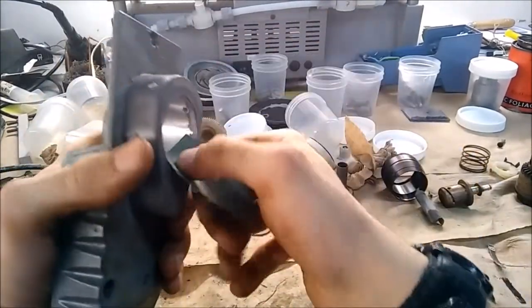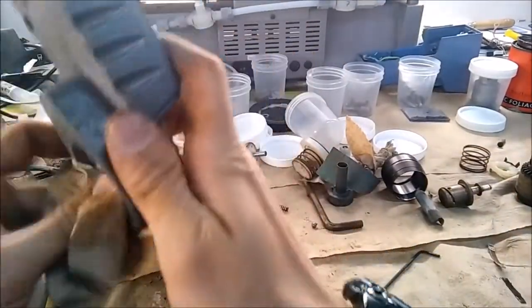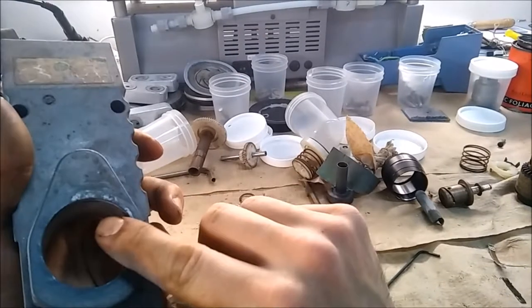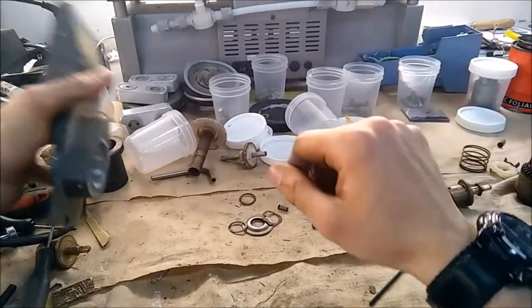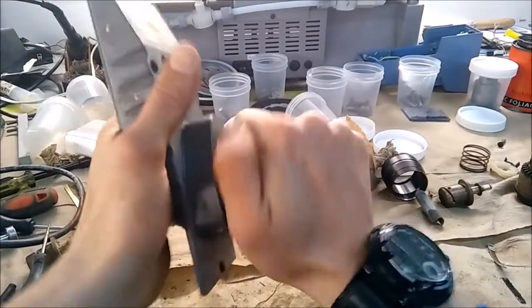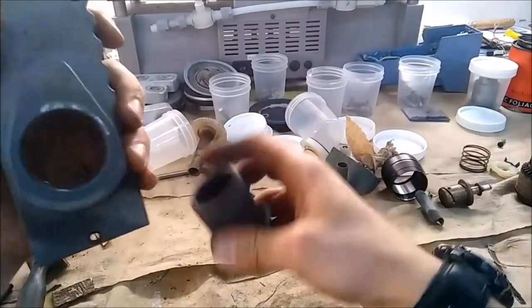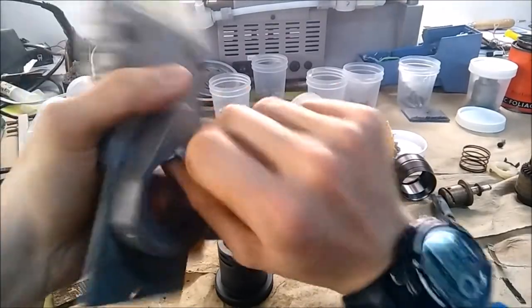You can see there's what looks like paint overspray or corrosion — probably both — causing the problems. There's a little port here I don't know the purpose of, maybe from manufacturing or lubrication, but it's allowing corrosive vapors in. What I've been doing is sealing it up with a little bit of silicone, which seems to be helping. I can see a little aluminum oxide in there, and I'm going to scrub it out with 400-grit sandpaper. Then I'll do a test fit without lubrication to make sure it moves smoothly, which it does.